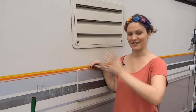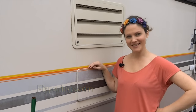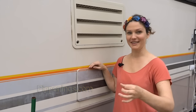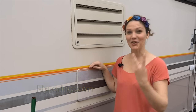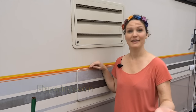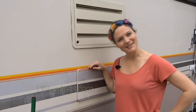Well, unfortunately, the thing that I feared, which was that raceway being too full of too many cables now, I think that's the case. I just could not get that one thin 10-2 cable down. I thought, how am I gonna get two thicker cables through there when I can't even get that other one through? So unfortunately, I spoke a little too soon.